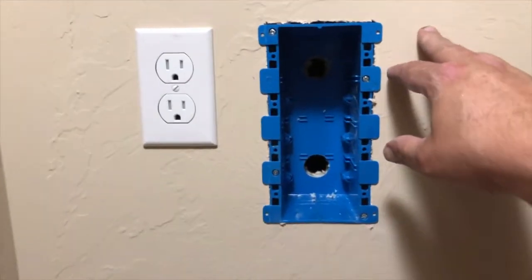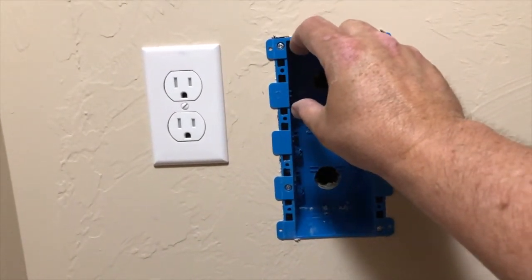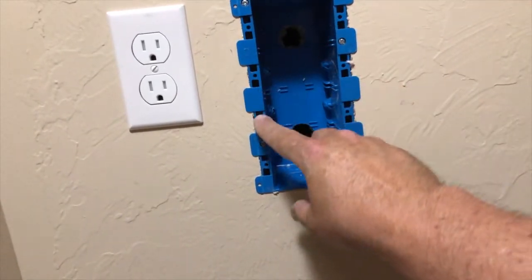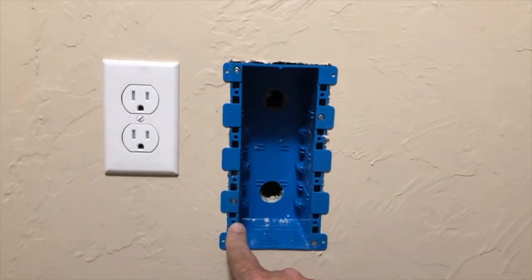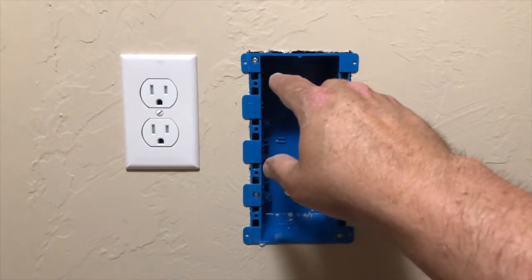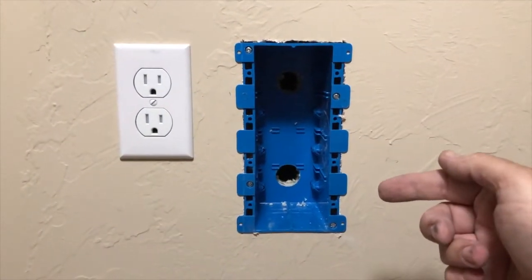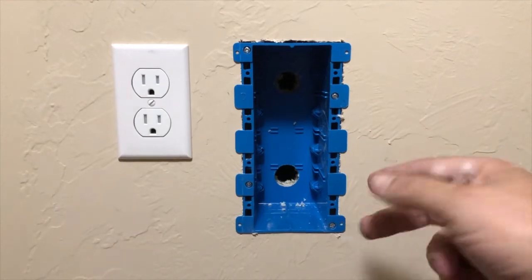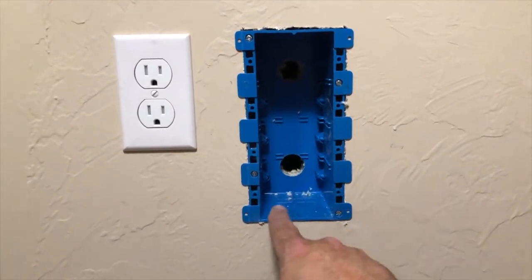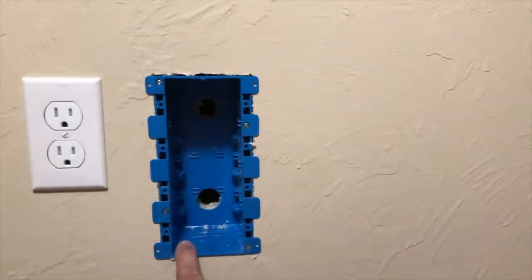So what I plan on doing is I'm gonna be putting in banks of six here, and here, of Keystone wall plates. And so I'll have, because each camera has a BNC connector and a power connector, this will be three cameras, six cameras, nine cameras, and then 10 cameras. If I even install 10, but I'm gonna wire it for that.